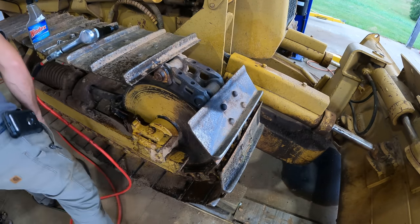I'm using this chain binder and these bar clamps to try to take some tension off of this joint so I can get my punch out — I just need to take some tension off. I bent this but I can heat it up and bend it back because I'm going to need it for the other side. I'm really trying to get that pin out without cutting it, and I realized I kind of got tunnel vision here — I'm missing something really obvious.